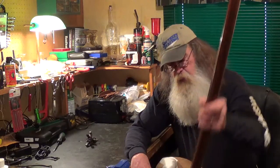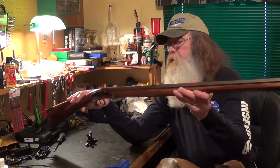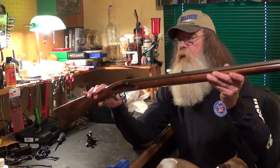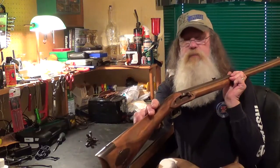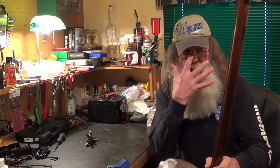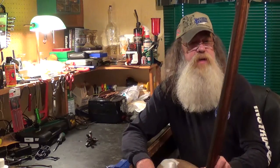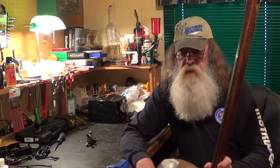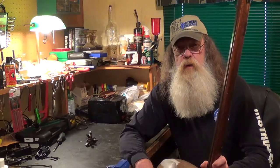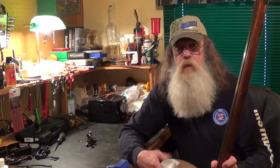I kind of feel like it was a shame. It's a Tennessee Mountain Rifle — probably not 100% true to form, but it's a pretty good replication of one. It's got a heavy barrel, about 15/16ths across a flat. It's stocked in cherry and the barrel is 41 and 3/8 inches long, so you'd more or less call that a 42-inch barrel. Judging by the twist on the ramrod, it's a 1-in-48 twist, which is supposed to be a compromise between conical and round ball.